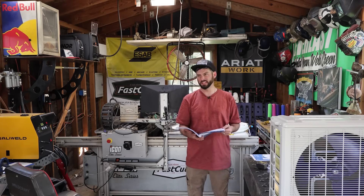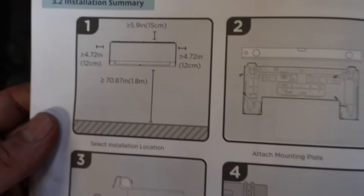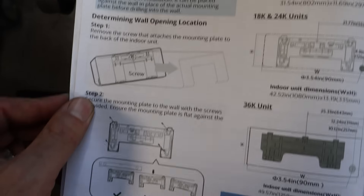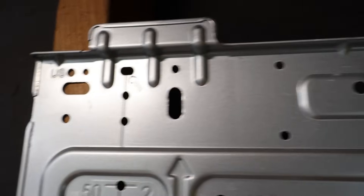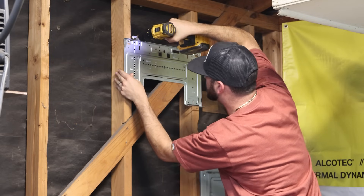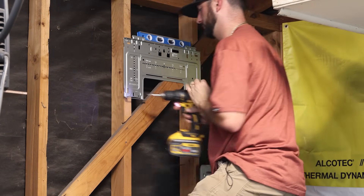Need some water. The first steps weren't all that bad — just trying to decipher the hieroglyphics on page 15 which gives you the step by step: putting up the bracket, putting the hole in, doing some taping. Starting off with the template and unscrewing the back side of the wall mount off the inside unit. Now I don't have a finished shop — no drywall — so really this template is good for marking and laying out the holes. Of course you're going to need a stud finder, but I can see the studs clear as day. We want to make sure that the bracket is level.